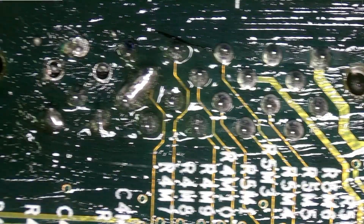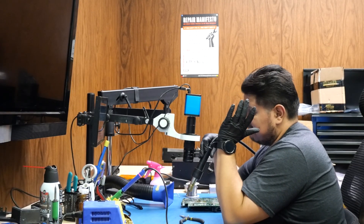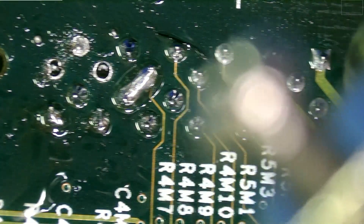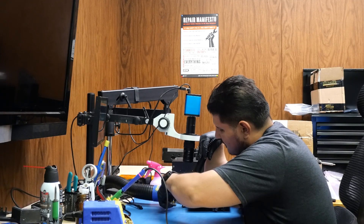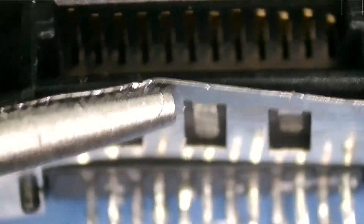I'll apply a little bit of flux to the remainder of this. The Hakko does work for this — I'm just baffled why it's giving me so many problems. We're going to hit it at 100 air and 450 degrees. I'm pressing down with my pliers on the very corner of the connector just ever so slightly. Once you've applied enough heat, you'll be able to grab this thing out of there like a tooth — and it came right out. Not in the best condition, not salvageable, but it is out of there.